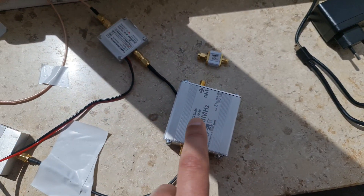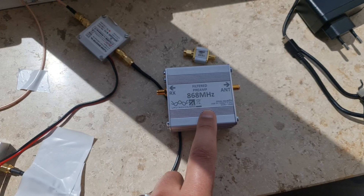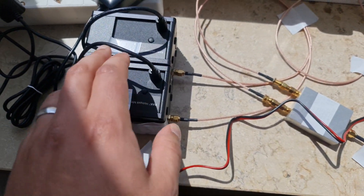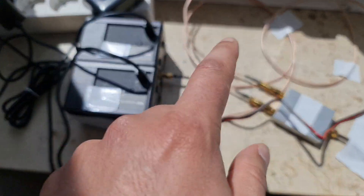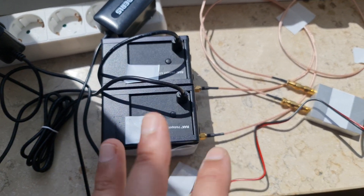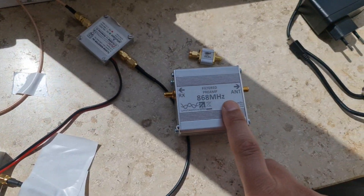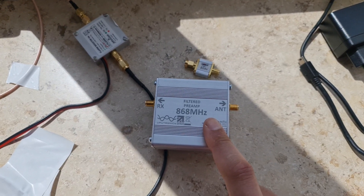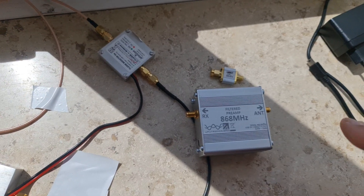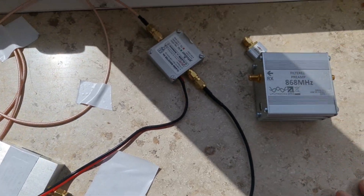This amplifier is perfect only if you have RX and TX separated. If you want to use it with multiple miners without separation — no beacon, you will lose money on your beacon and you'll always get invalid. When you get invalid, your miner takes a break between seven hours and one day. In my opinion it doesn't work to put a 100 euro amplifier that doesn't let your TX cross. Lately you need to beacon and witness and collect HNT from every possible situation — the rewards are down.